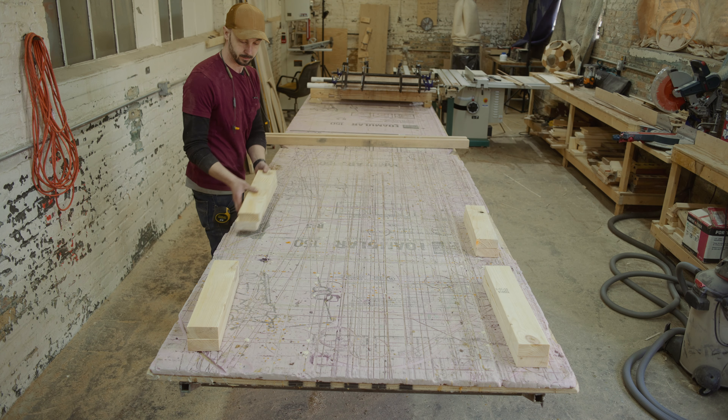After letting the tabletops dry for a day, I began prepping them for what would be the most time-consuming and hardest part of this build — making the table appear thicker than it actually was. I wanted to challenge myself not only making the biggest round table I'd ever made, but also adding a bevel to the edge. Pro tip: I recommend using a paint scraper to remove as much excess glue as possible before sanding — excess glue isn't good for your saw blades or planer.